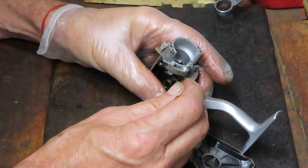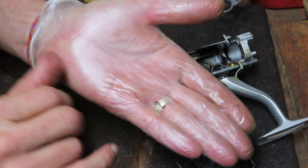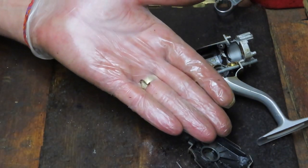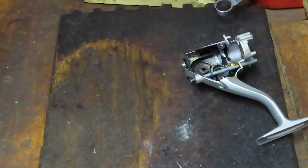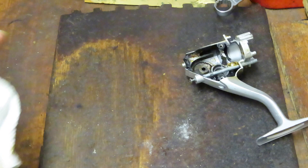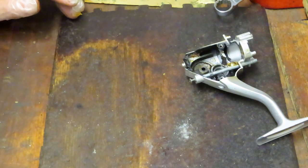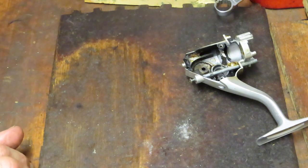It's generally going to fall out if you don't, and you're going to lose it. So that's what that spring looks like. And we're just going to go ahead and wash those parts now in an ultrasonic cleaner. I'm going to use a citric acid based solution as part of that. Again, it may take off more than just the salt, but I think that's prudent at this part.